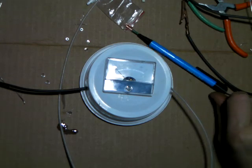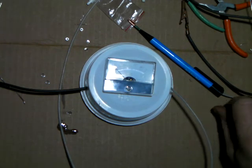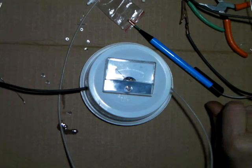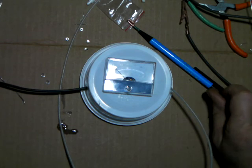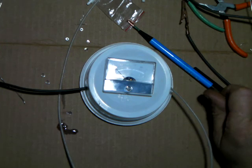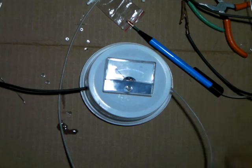So have a fine one, and in our next video we'll get back to working with transformers. I think the next one coming up will show how to take windings off of a microwave oven transformer, so we can take the voltage down from 2,700 volts. We're going to remove windings so that it'll give you 2,000 volts or just slightly above. 2,100, 2,200 is about right for a 4CX250 in that category. And if you had other tubes that use less, why, we're just going to take more turns off the transformer, and I'll try to show that in the next video.